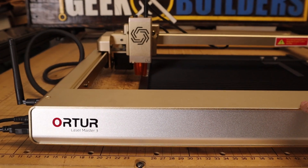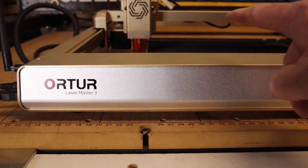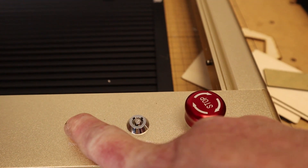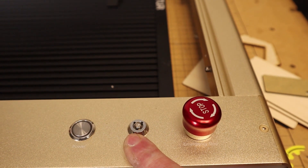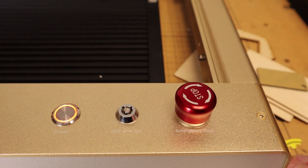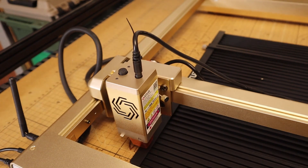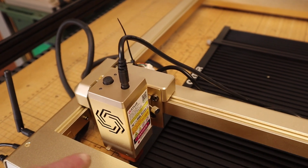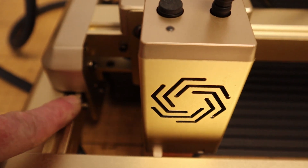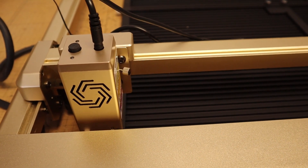Some other key features include a very low profile, almost race car-like construction — almost too low in some ways, but I'll talk about that later. There's built-in USB, Wi-Fi, and power on the side, an easy push-button way to start the machine, and a built-in emergency stop button. It also has a mechanical stop rather than limit switches: when the axis hits a certain spot, a small screw registers the end position. It knows it's at its origin and picks up from there, and it works really well with LightBurn.